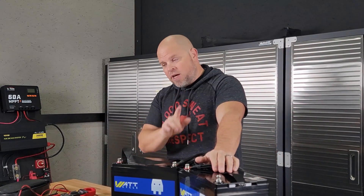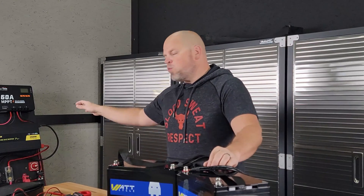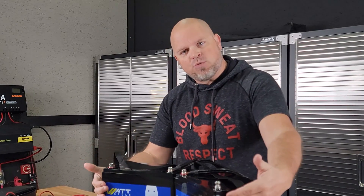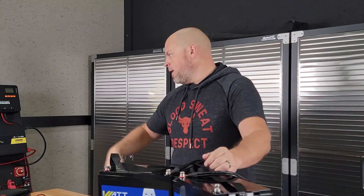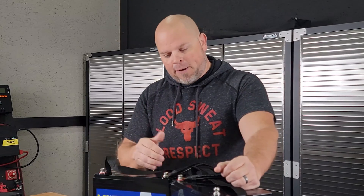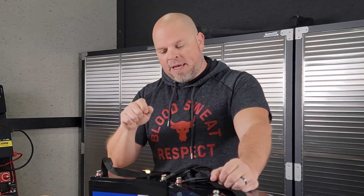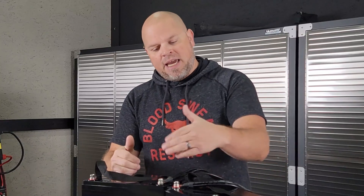Something important to discuss: I could not use what I have right now with a 12 volt inverter — I would have to connect it in parallel to keep it at 12 volts. If I hook a 24 volt battery to a 12 volt inverter, I'm going to have problems. For the sake of this video, I'm going to test one of these batteries for the BMS and the capacity. I just wanted to provide a demonstration on how to connect these in series and in parallel.